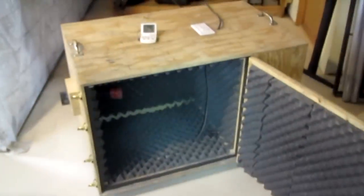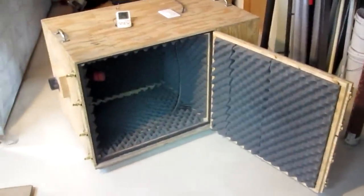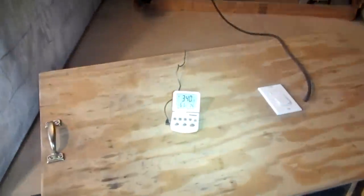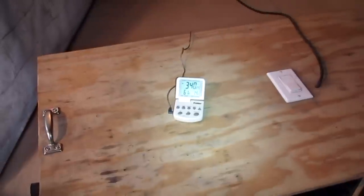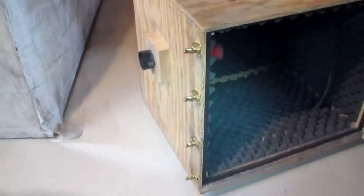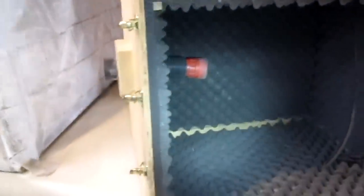Here's the cabinet itself. You can see it's lined with acoustic noise absorption foam. I have a kitchen thermometer that I use to measure the exhaust temperature of the air coming out of the cabinet, and that's how I know what the temperatures are when it gets clogged and when it's not. The hose gets attached to the outside of the cabinet on the front face. There are four buckles down the side to close the door, with a nice soft foam sealer on the edge that gives a nice airtight acoustic seal.